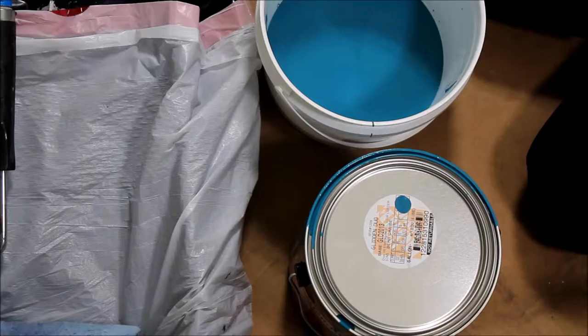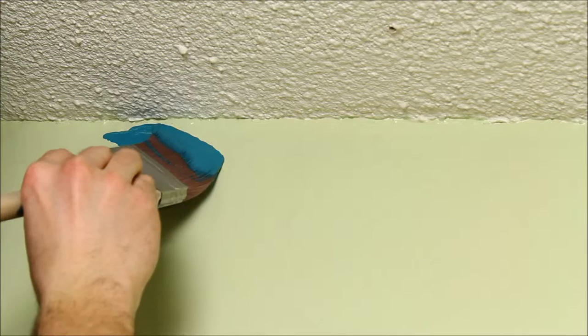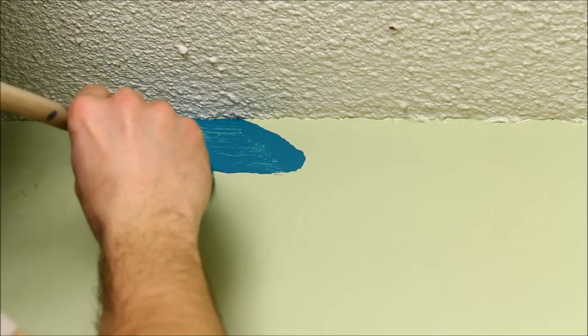After you've got everything mixed, you might want to use a little roller for cutting in — it's not necessary but it's a decent idea to have it. And now comes the fun part: cutting in. You want to take your time here. I'm using the paintbrush so that just the tip is towards the top of the ceiling to deliver that paint right up there, so I can get nice coverage from the transition of the wall to the ceiling.